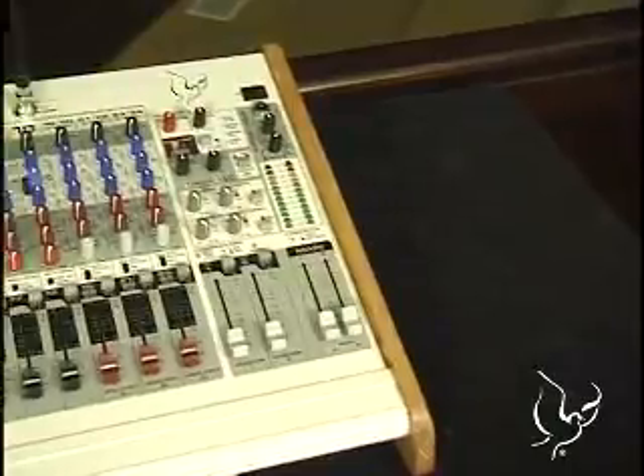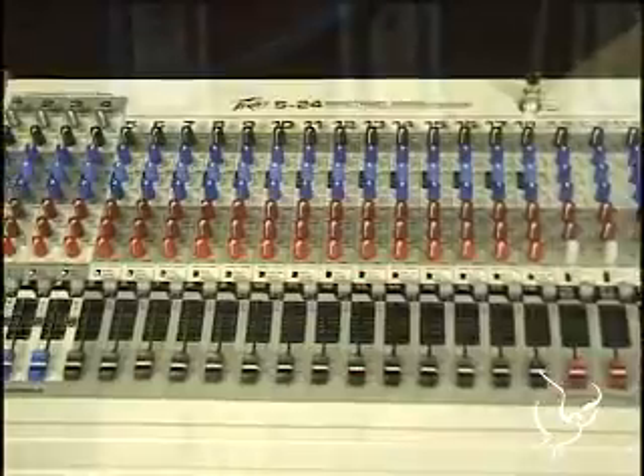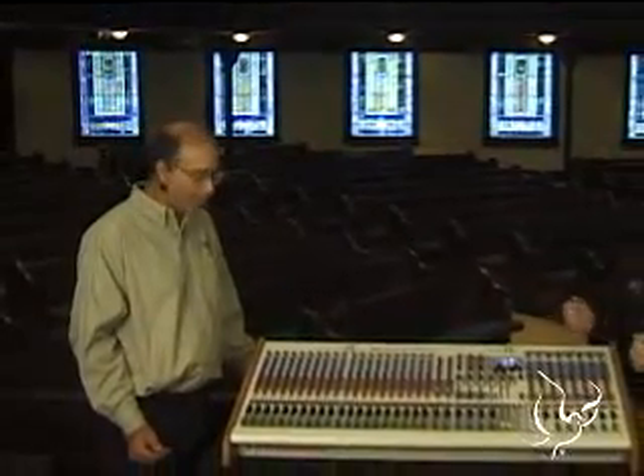So we've got a great engineer inside of here. That's exactly right, and it's all built into the electronics of the unit. With automix, unlike a standard mute and unmute type of gating system, we're talking about true gain-sharing automix. Instead of turning the microphones on and off, it automatically looks at what the signal level is and turns the microphones down only as much as needed to give gain to the other microphones and eliminate interference. It's a very smooth and transparent operation.